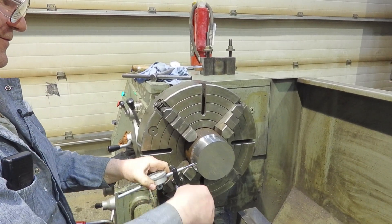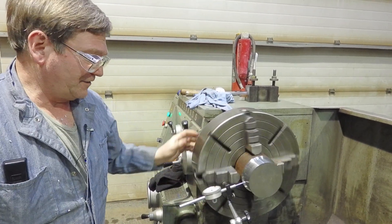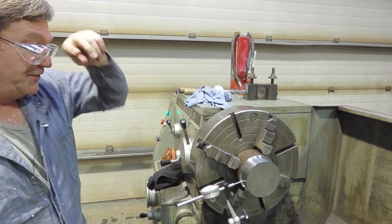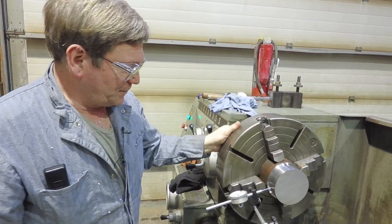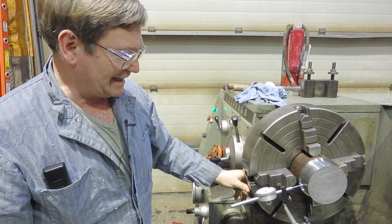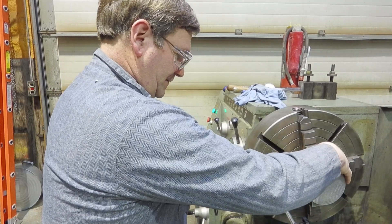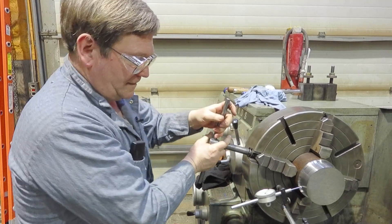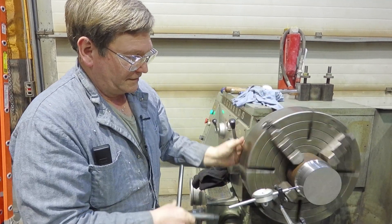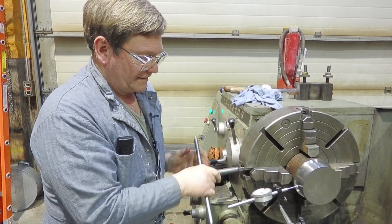We will see how far off we are just by that technique. So we are out quite a bit yet—we're out over a hundred thousandths, but it still gets us somewhere in there. I like to pick whichever two jaws are the most apart. That one is at zero; this one is way back to minus a whole bunch. So I'm going to go somewhere around 50. Semi-close. This one here needs to go looser again—it needs to be tighter, looser, tighter.